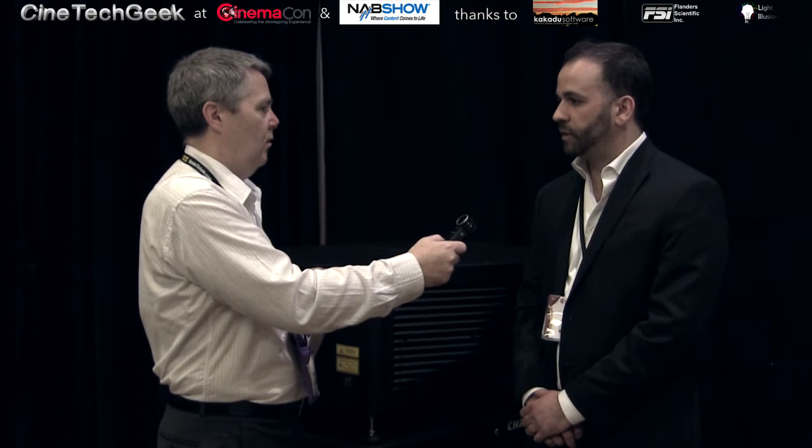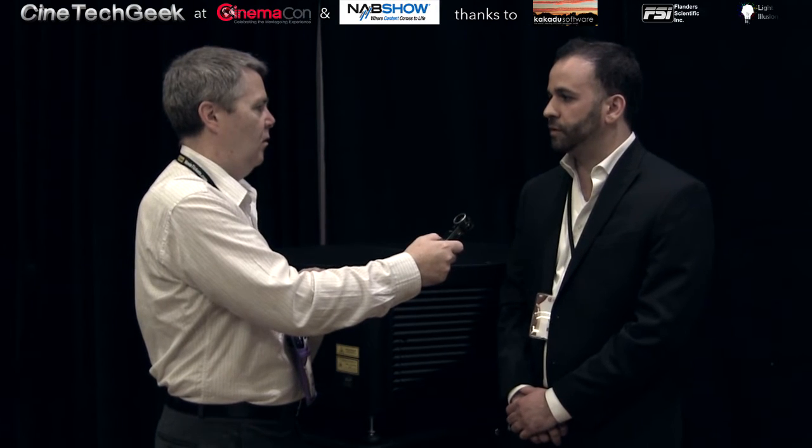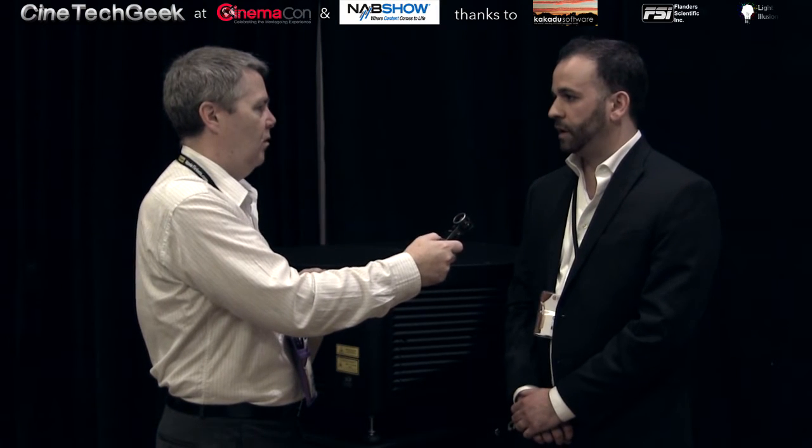So basically, if you've got a big xenon-based projector with big lamps, this is the future path — if you've got a system that's working and you want to jump to laser, this is probably the projector you go for. It'll almost double the output capability of the highest-powered xenon projector available today. This EWD system will do 60,000 lumens out of a single head and accommodates all 3D systems with the exception of Dolby 6P, because you need the dual head for that one.